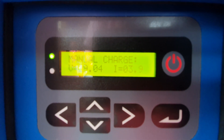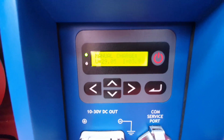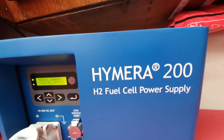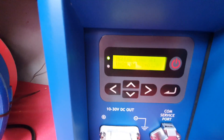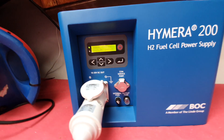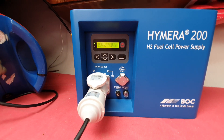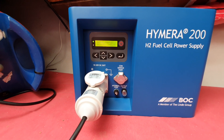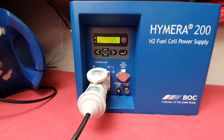Still charging — hope you guys and girls can see it. What we are now actually able to do is draw power and provide power to the battery of the electric motor. This is a 200 watt power supply, though it's actually running a little less — just over 100 watts. But if we were moving with this boat at around 300 watts, which would make this boat move fairly easily, you would end up using your battery much less, because it just runs out much later than when you don't have this power supply.